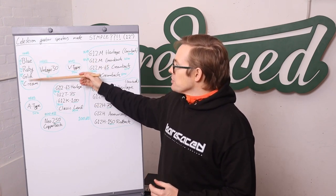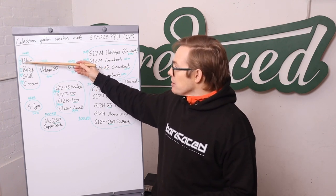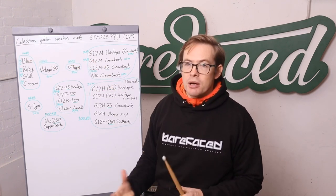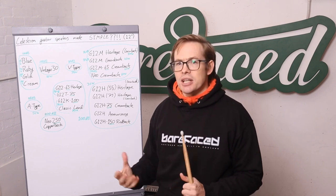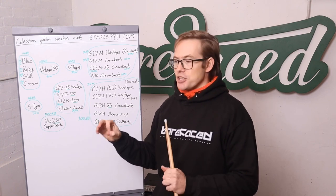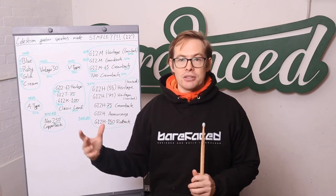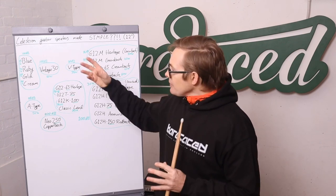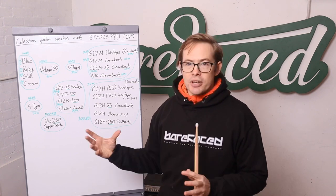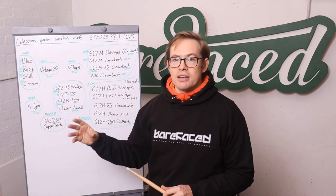If you put 90 watts into a Blue — like a Cream can handle — you just toast it. Also, if you try to put much more than 15 watts into a Blue, it's going to get into a realm of being more broken up, a dirtier sound, and it will go beyond that sweet spot of dirtiness guitarists crave. The speaker break-up reaches a point of horrible, pointless mushiness. So there's an optimum amount of dirt we want to generate within a guitar loudspeaker.